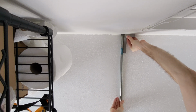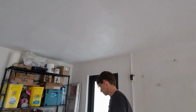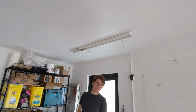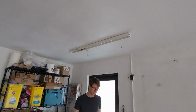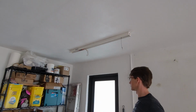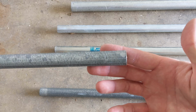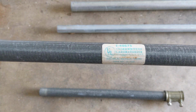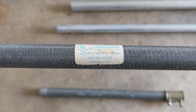This will do. I'm hanging the fixtures on 2 screws. In each case, the screw farthest from the center goes into a ceiling joist, and the other screw into an anchor, which is weak, sure, but these are very lightweight, and the closer end receives support from the conduit anyway. This is old conduit, but no matter, it's in great shape. It's going back up on the ceiling.